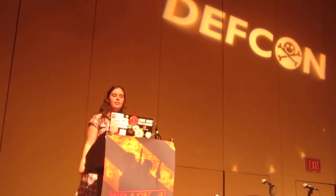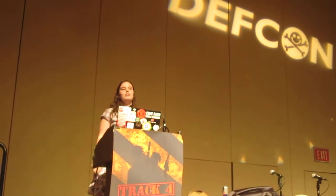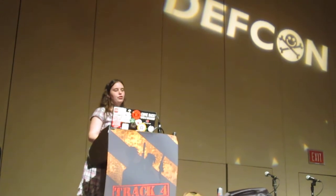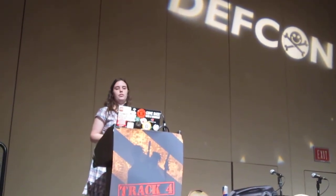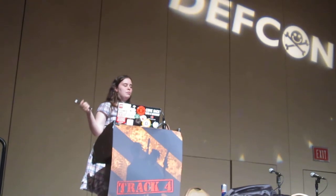And so we had this on a friction mount for our adjustable chain. This was really embarrassing, especially to the sponsor, who had just sponsored a very nice powder coat job. So yeah, no painting on friction mount parts in general, because now they're thicker than they used to be, and you're never going to get them apart again.